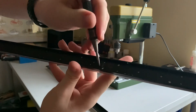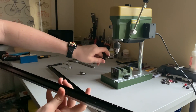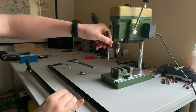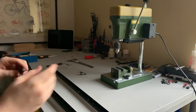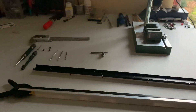Pre-punch every hole so that when the drill bit is spinning it will directly find the center and go straight through. Sometimes when you're drilling it will go off-center, and then your hole won't be exactly in line, which causes problems.